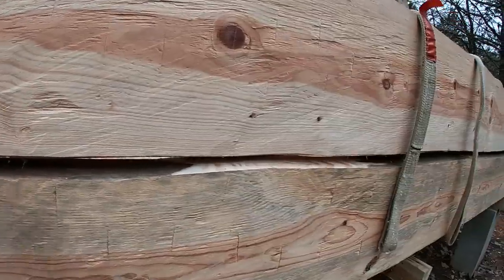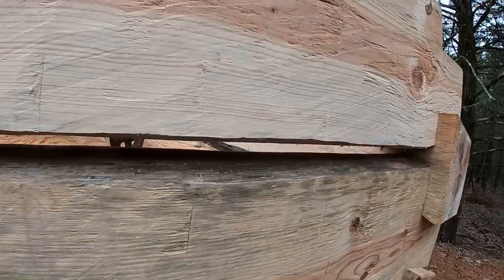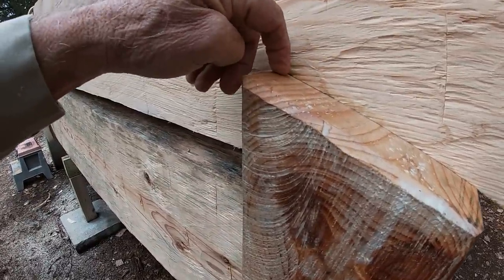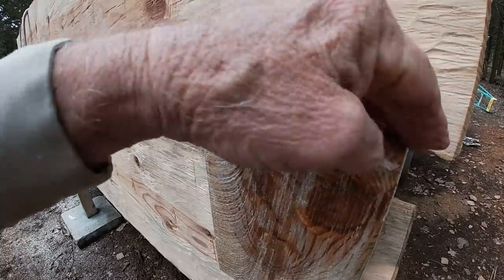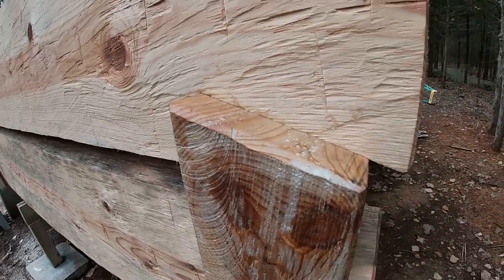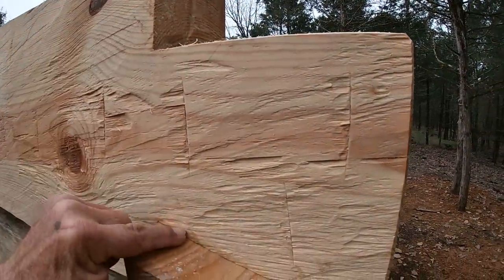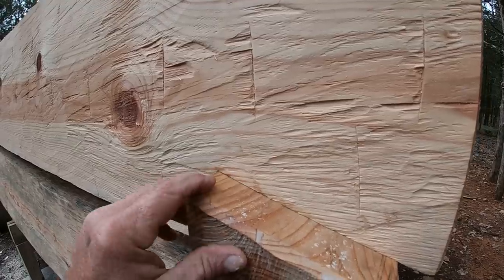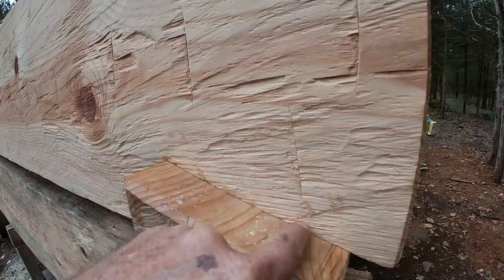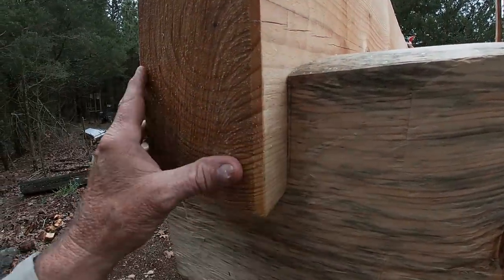Let's go look at the other end. My chinking gap is sweet — it's not too wide. There will be places that it's wider than others, that's just part of it. I've got just a tiny bit of a gap right here, but everywhere else it's sitting really tight. I can take care of that and make this whole face sit completely down. I could leave that and just let the weight of the next log rest on top and cause that to tighten up, but I'll go ahead and do a little something to this. I can make a handsaw pass underneath and tighten that up. I also have shoulder passes to make here.